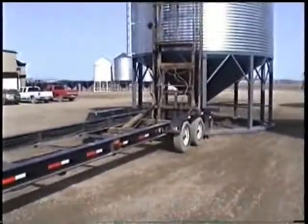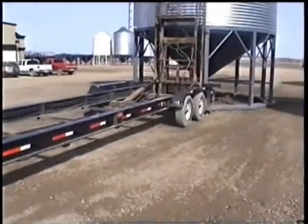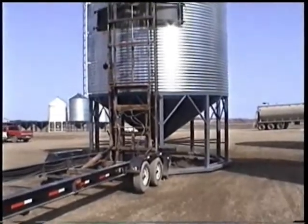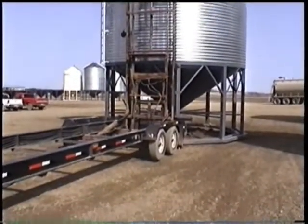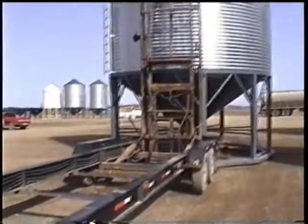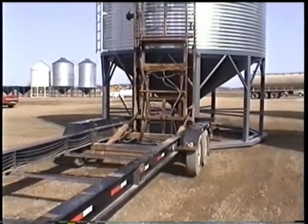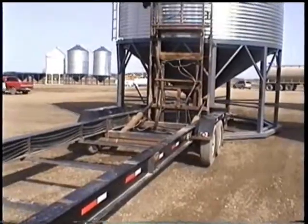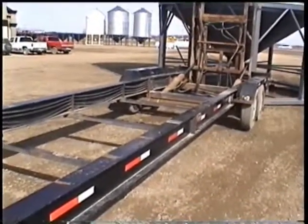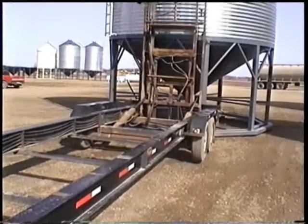Of course when we're handling this bin and moving it up and down, we make sure everybody is out of the way. Safety first — always pay respect to what we're doing. The bin is coming up even. If I were to set it down and loosen even one link on Brad's side, this bin is going to come up crooked. As you can see, we're parallel with the tilting deck and the leg — that's a good indication that you're straight with both the trailer and the bin. Just make sure the deck and the leg are parallel. If it doesn't come up straight at the beginning, it won't lay straight. You can set it back down and readjust your chains to make sure they come up straight.